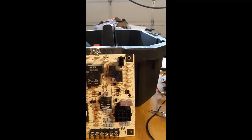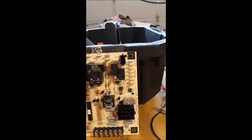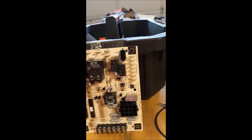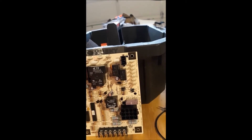The line and transformer across the top of the board is your line power coming in. All these split-system furnaces — if it's not a package unit — are going to be 120-volt appliances, so that line is going to be your L1 coming in. The transformer connection is where the high voltage for the transformer connects to power it.